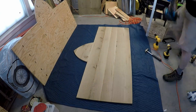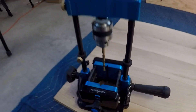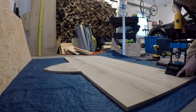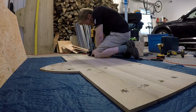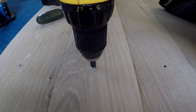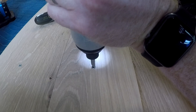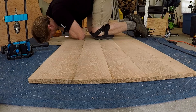I removed the core and got to work drilling the holes for the threaded inserts. It was critical that I not drill too deep, otherwise I would blow right through the front of the sign — quite the party foul. Fortunately, a drill guide saved me from that ignominious fate. The threaded inserts are stainless steel to avoid corrosion. I installed them using a specialized bit, followed by an impact driver and a little final tweak with a hand screwdriver.